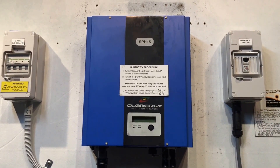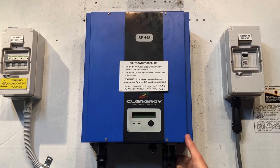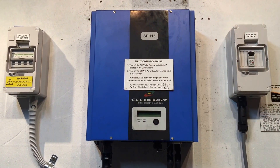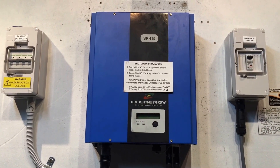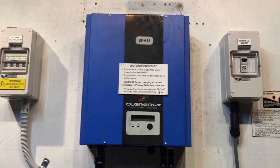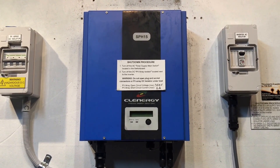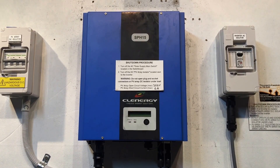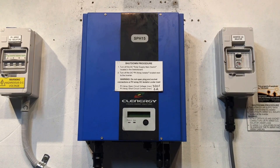So you want to be checking those things. If you've checked the cables in the inverter are all plugged in correctly, you've checked that the isolator beside the inverter is in the on position, and you're still getting a completely blank screen and the sun is shining, you are going to need to get some expert help to work out what's actually going on — because it should be working.